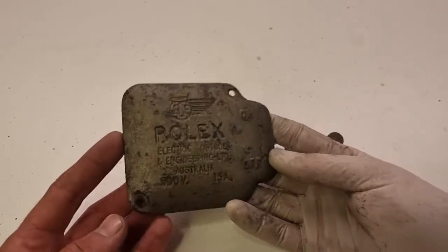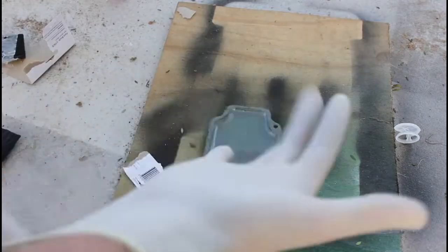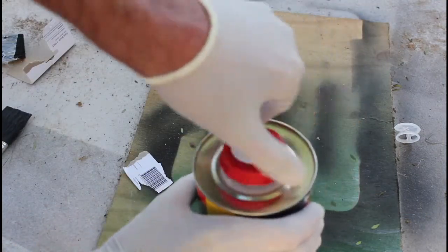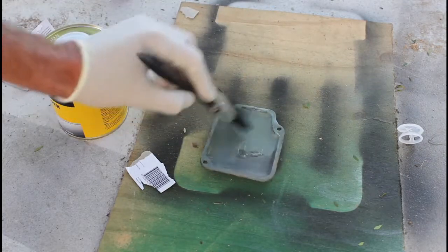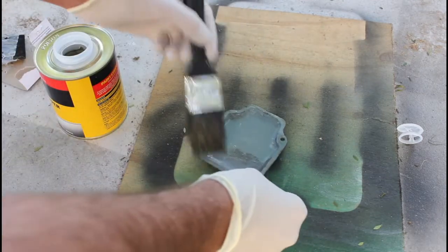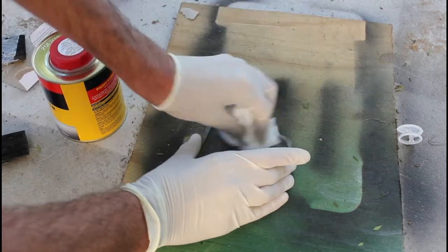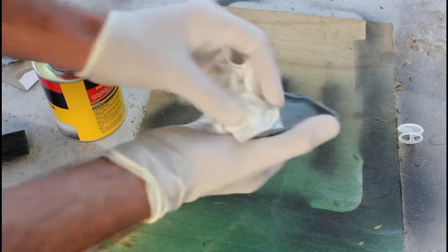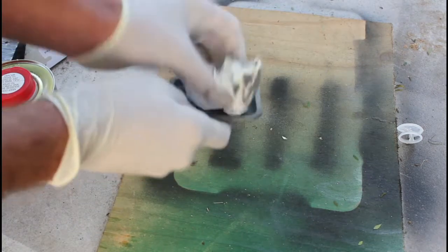That's nice and clean now — all we've got to do is worry about the paint. To attack the paint I have a can of paint stripper from the hardware store. I've already done a test batch so I know this works. We'll put on the gloves — I'm also wearing my big filter mask because this stuff really stinks and it's bad for you; vinegar is just vinegar, but this is something else. We give it a good coating, let it sit for three minutes, then rub it off with paper towels. Some of the paint proved more stubborn than other areas so we had to do several treatments, but eventually we got the surface back to bare metal.